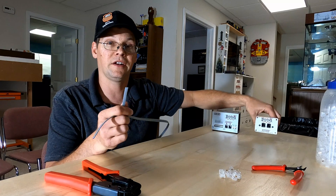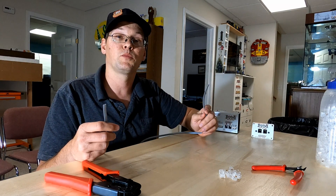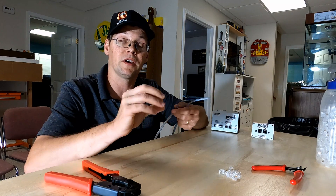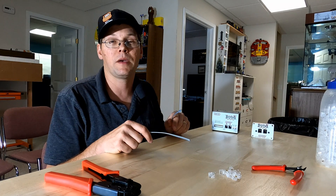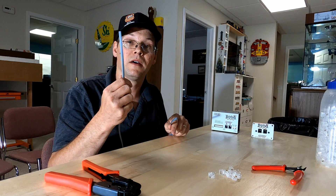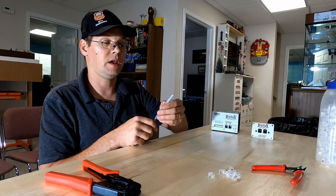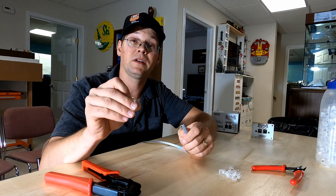It's not a standard telephone cable design, so you can't just use a 6-wire pre-made telephone cable because of how the connectors are crimped onto that cable. They're in a different orientation than what we need for the LocoNet cable, so we're going to get some flat 6-wire telephone cable and some RJ12 6-conductor 6-pin connectors.